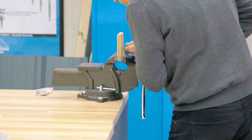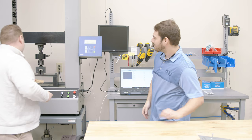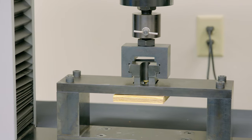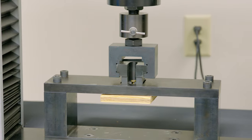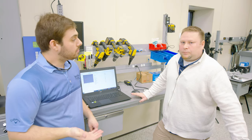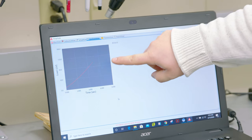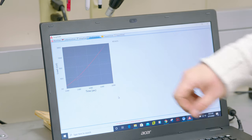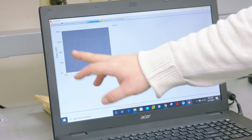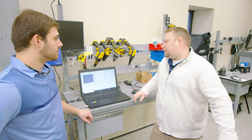This is 5/8 plywood and we'll see what the load is. The pullout test was completed. We're looking at the graph that shows load versus time. You can see as it's pulling, it's a nice, pretty straight curve. And then when it starts to pull out of the wood, your load drops off and then you end the test.